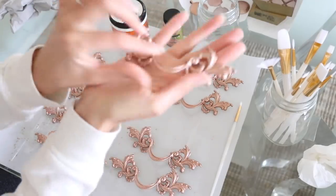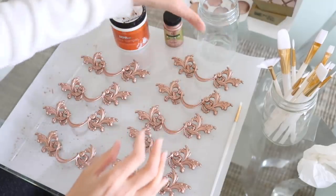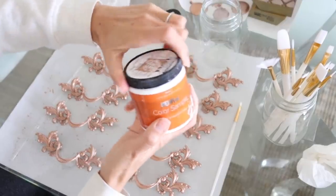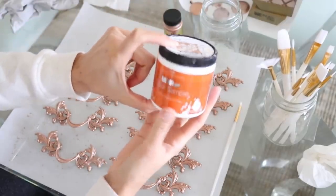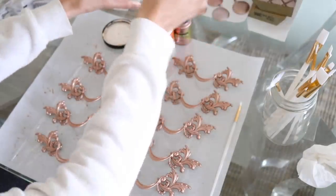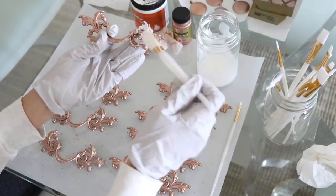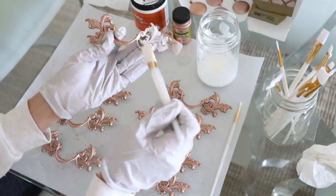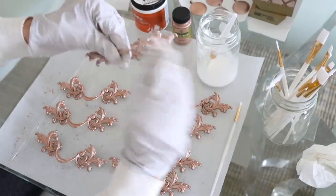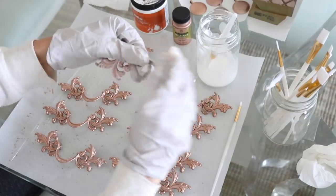I like to whitewash hardware when you want another color settled into the detail. I have a little jar with just a tiny bit of water — just enough to mix up a little bit of white paint. This is just regular interior paint from one of those little samples — White Blush from Behr — it doesn't matter what color you have, this is just what I already had. So I mix some of that white paint into the water, run a light coat of our whitewash over the hardware, and make sure it gets into all the detail. After I paint on the whitewash mixture, I just take a wet rag and lightly buff over it — that just wipes away any excess so it doesn't turn out too opaque. It brings out a more multi-dimensional look and adds an elegance to the piece.